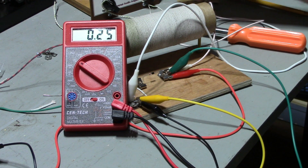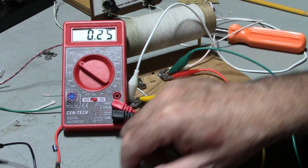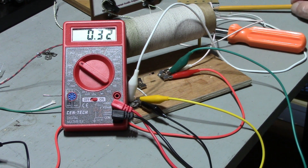Now experimenting with some electrolytic capacitors — if you put a 10 microfarad capacitor across the output, it cuts off the audio. But look at the voltage: it's now 3 tenths of a volt. And we don't care about the audio. We just want some nice smooth direct current.